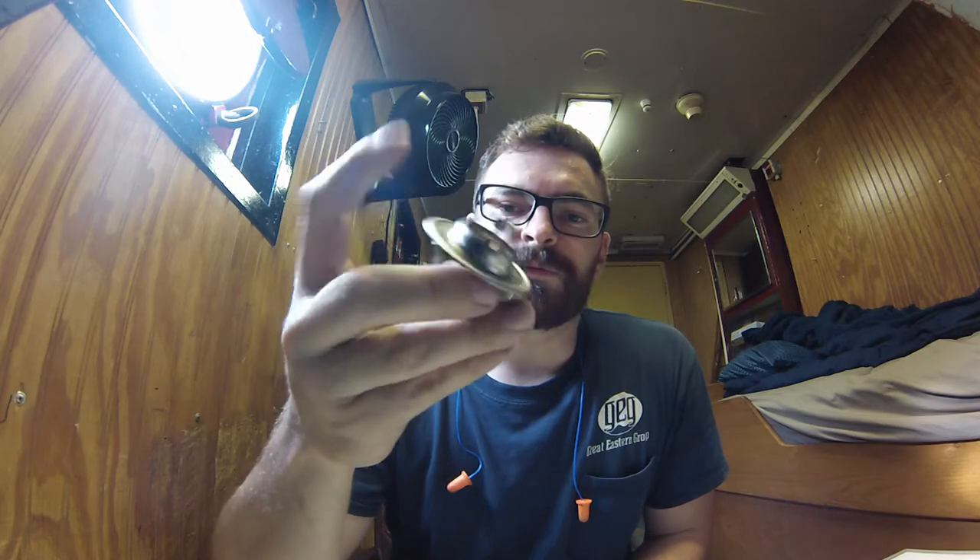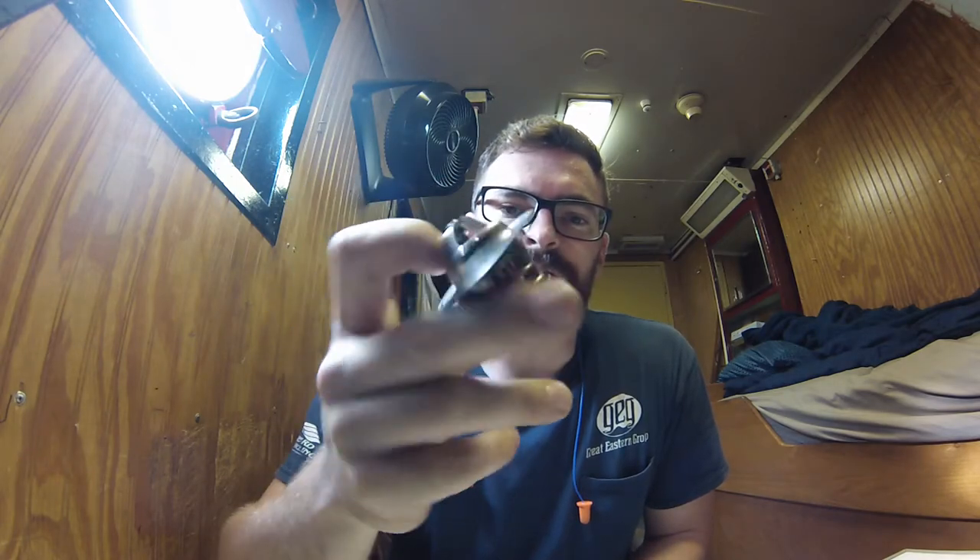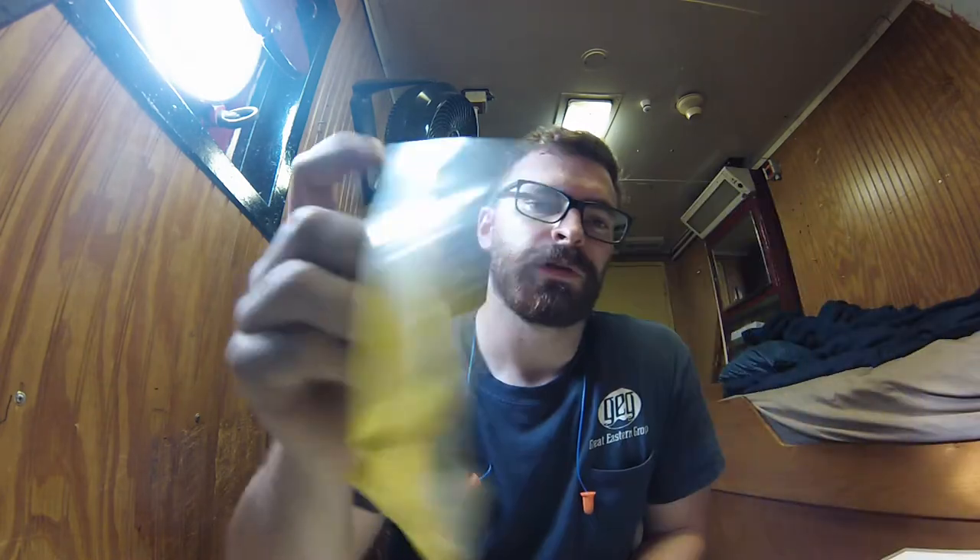It might still work, but it won't work as well. So if your engine gets too hot, do these first. They're pretty standard, but we buy the John Deere brand for twice the money — they're all the same. This one opens up at 83 degrees Celsius, which is slightly less than boiling in American numbers. They're all this exact same design.